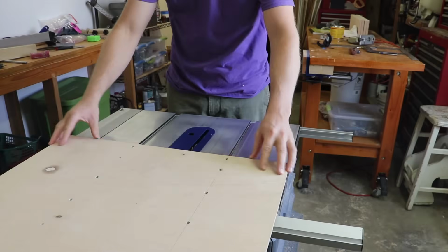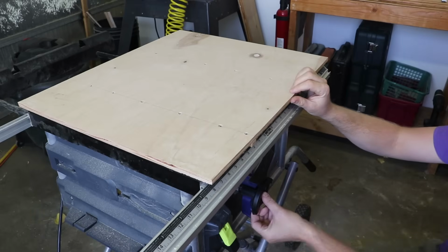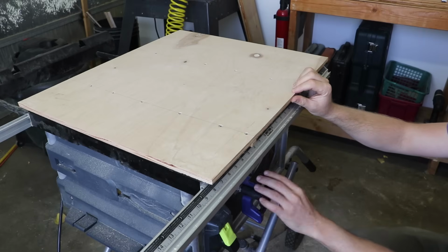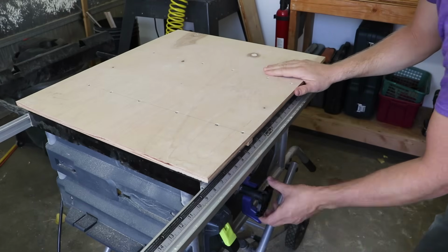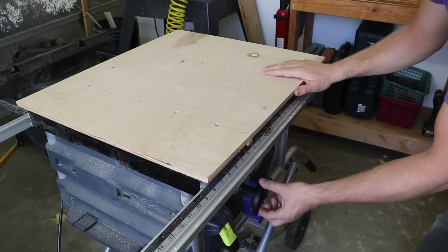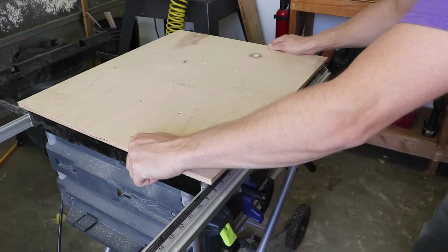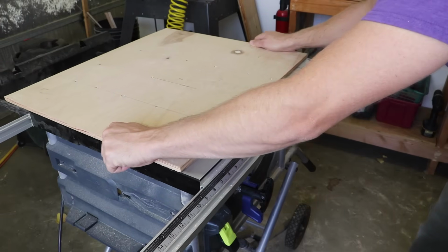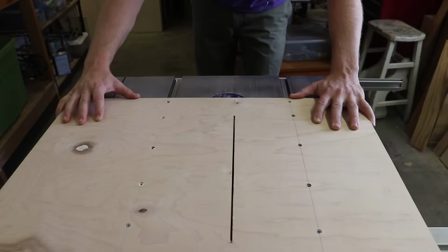With the sled back on the table saw, I slowly cut the slot for the blade with a plunge cut. This is done by raising the blade slowly into the workpiece. Plunge cuts are not considered safe cuts. Alternatively, you can attach the far fence and cut into the sled as if you were making a through cut, but stop short of a through cut.